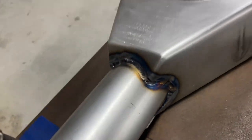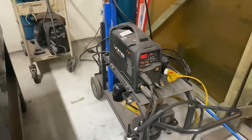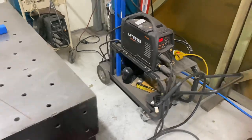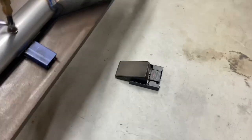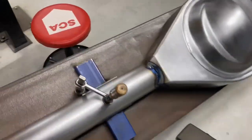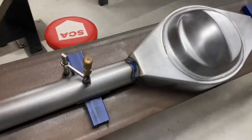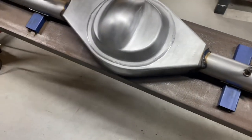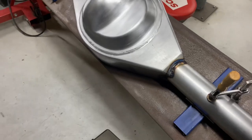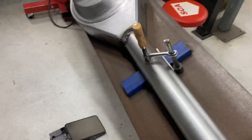A good bit of fun. Got some real nice colour, which is always a good indication that my amps are pretty good. That was about 120 amps on the old Unimig Razor - good little welder that, so easy to set up. With the foot pedal, it just frees up my hand to put it into whatever position I want. Good colour all the way around - pretty happy with that. Should have done a little bit more of a test position first just to figure out where I was at, but I kind of found where I needed to be. Underside all welded up as well - same thing, pretty good colour.